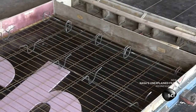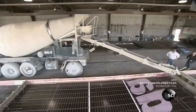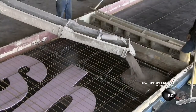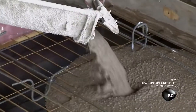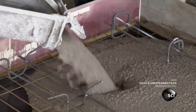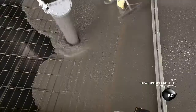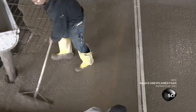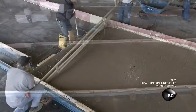They're now ready to pour concrete. A truck dispenses the concrete directly into the form. The concrete flows around the steel reinforcement. The steel will keep the wall strong when the concrete expands and contracts as the weather changes. The team spreads the concrete and levels it with a tool called a screed. This first layer of the wall panel is essentially one side of a sandwich — it will be the exterior part of the wall.